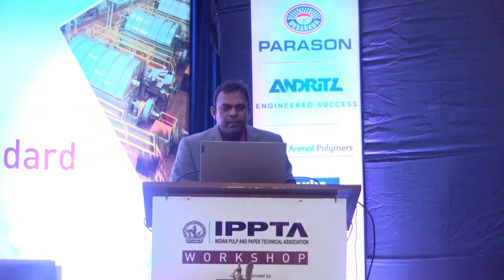So this is a typical wet washing system for bagasse. If you see here, we have this depithing section, then we have bagasse storage, then after that we have this wet washing system, then we have the dewatering for this, that is called the aqua separator.